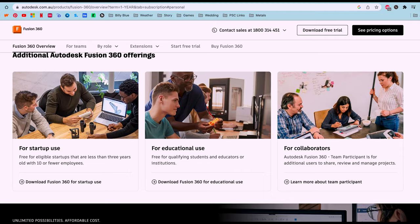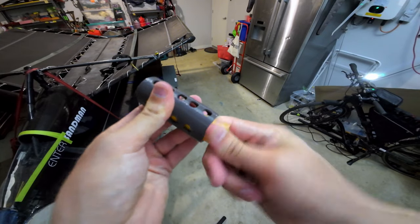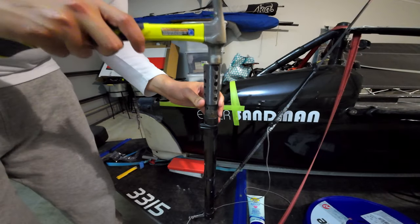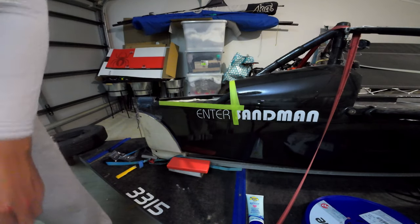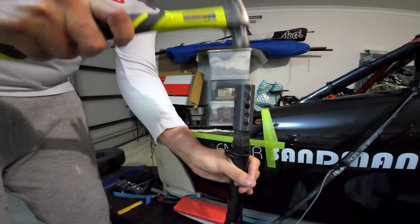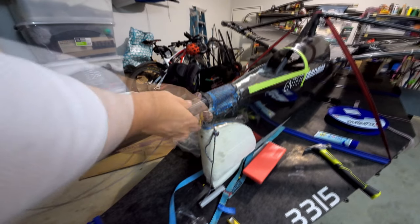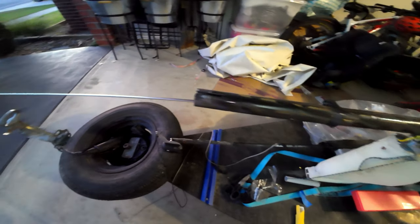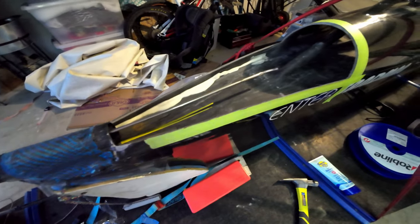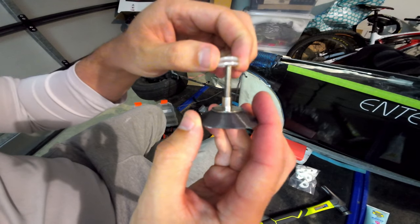You can actually download Fusion 360 for hobby use for free, and I'm no sort of computer expert, but I did a bit of a course on Skillshare — not the whole thing, but enough to figure out the basics — and then made this bush and hammered it onto the end of my bowsprit. One of the engineers at work suggested I put a heap of holes in it so the epoxy goes through and takes most of the load, so the 3D printed bit isn't actually doing much work. And then we had our bowsprit in — that was the first time I got the push rod in.